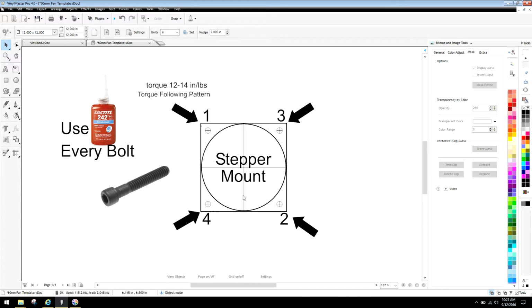And when I say later, it'll usually be based on vibration induced from the machine. Again, the machine will have stress on it when it's fully assembled, so take that into consideration. That's why, once again, following a torque measurement pattern across the entire pattern of mount will help you understand that the machine is balanced. We want to keep this motor mounted and balanced the whole time, as close as possible, all the way through, so that we know that pressure on that motor is even. We want to keep it as evenly distributed as possible.